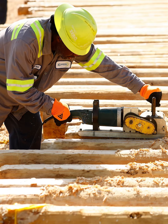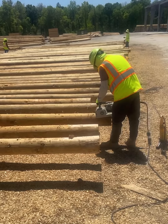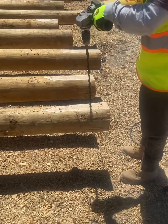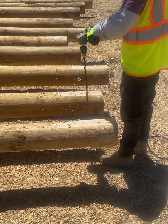A gain is applied to the pole to give a flat surface for cross arm and hardware positioning during pole installation. Poles are drilled per customer specification to save linemen time and effort to install hardware to attach wire, insulators, and cross arms. Depending on the customer specification, some customers get holes, some get gains, some don't. The purpose of the holes and the gain is to have these poles as ready as possible for the linemen working out in the field.